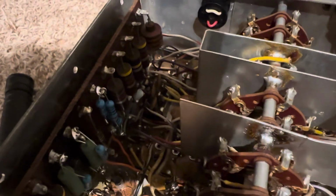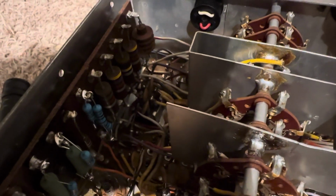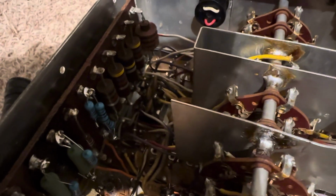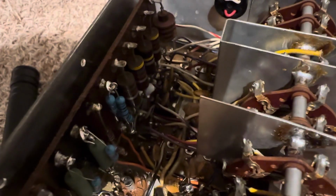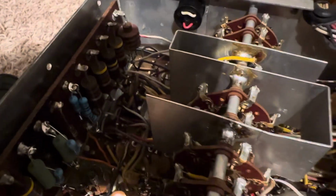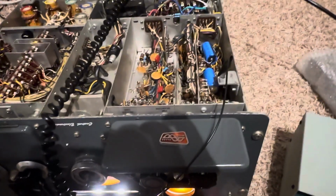And then this little CF right here, that's the bias for the finals. And I kept cranking those resistors down until the finals worked right. Because why is that different? Maybe it was different because the 340 volts was 302 volts and I didn't compensate this yet. I don't know. But at any rate, this thing seems like it's working better now for many reasons. What else did I do? That's about it.